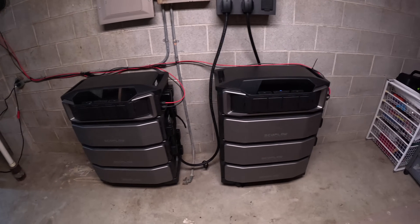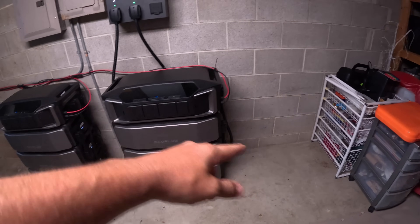They're very good-looking units and we've got room for a third one. The cord's very long — plug it in and it does its thing. Adding another one is going to be huge because they all share the load, so batteries are getting depleted less as long as you've got the input. My future plans are to run four more sets of wires — the low input on these two units and the low and high input on the third inverter. At some point this year I'm going to run all the wires so everything is set up and whenever I get the third unit, all I have to do is hook it up.